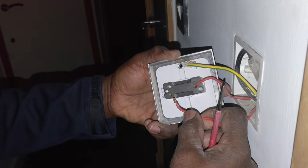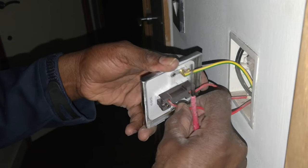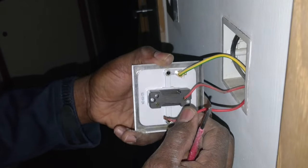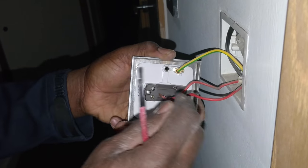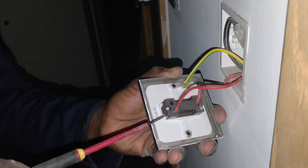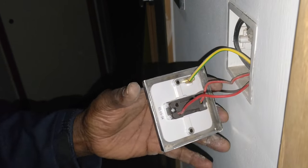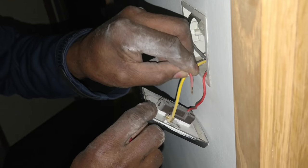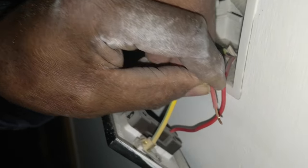Also, if there was an indentation in the cable - did you see that? Sometimes the cable can break at that point. There's no connection there on L1 - it's in on L2. I'm going to take this one out. You see the indent in the cable - that's not too bad.